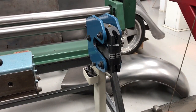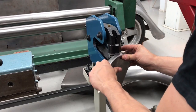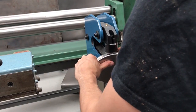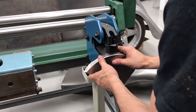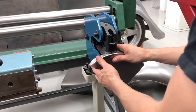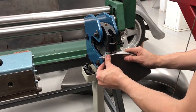This is a Bailey Industrial Shrinker Stretcher Kick Shrinker. You can use stretching or shrinking dies — we've got the shrink dies in here right now. What this does is it grabs the metal with some gentle serrations and forces the metal together, forcing the molecules together and thickening that flange as it shrinks.